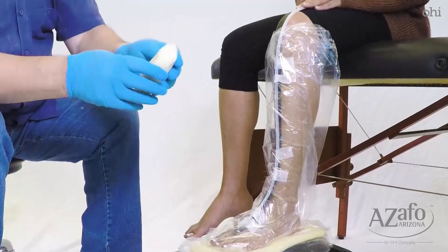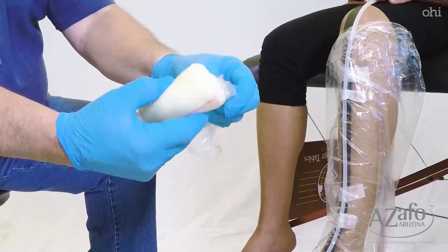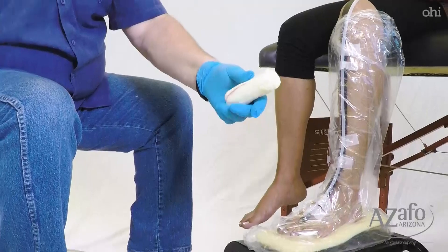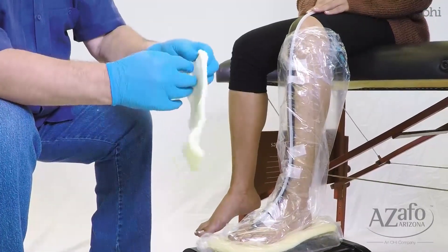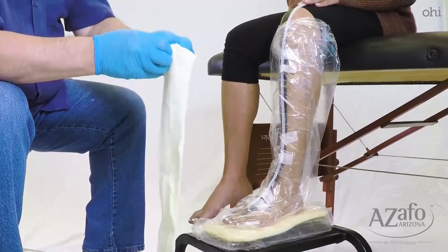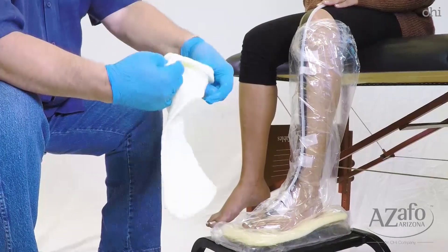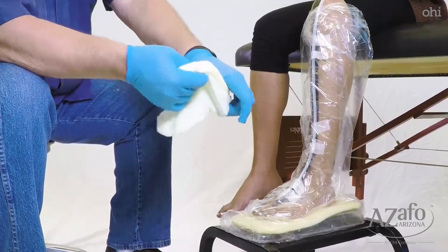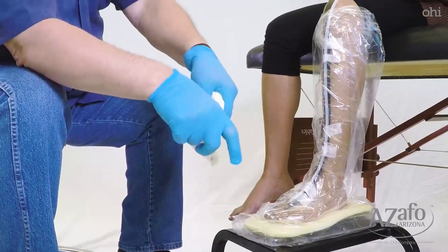Some of you that have used STS socks in the past — they used to be rolled up and now they're not. They're layered together and they're inside a piece of cellophane. You take that off and discard it. Then you unfold it completely, and roll it up yourself as if you were going to roll up a sock to put on your child or yourself. It takes a little bit because the material is sticky with the resin. Just try to keep it as straight as possible. Roll it up till there's about three inches of the sock left.